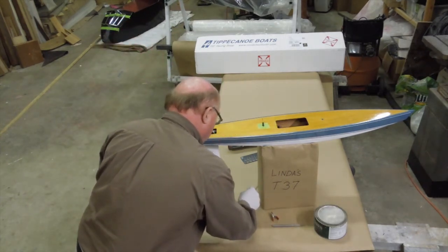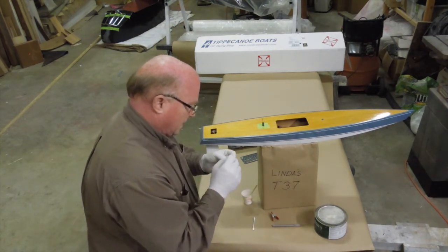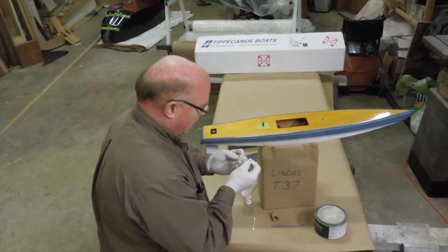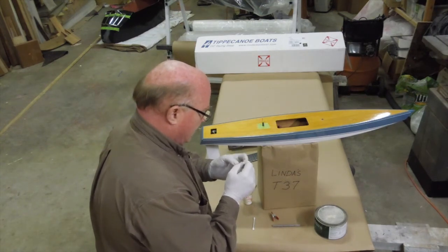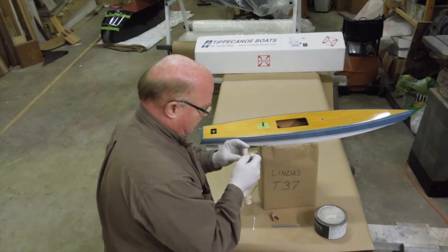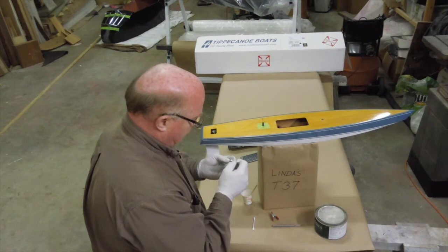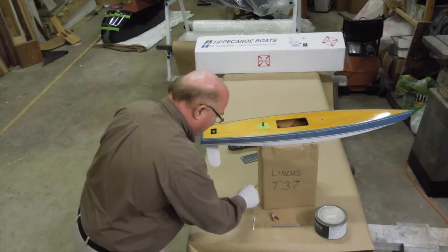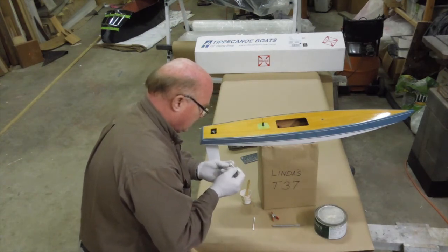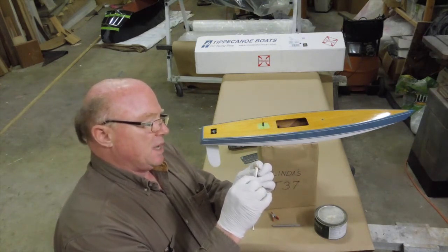So let me get the epoxy here. And I'm going to wet this out. And you know what? I'm going to get the whole thing wet out. I'm going to get the top saturated. And that's so that if I get water on this, it'll be protected. All right, so now it's pretty well coated. On my bond side in particular, though, I'm going to put just a little extra spot. So here you can see I've applied a little bead there.